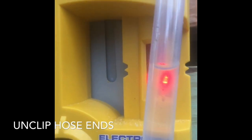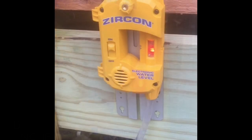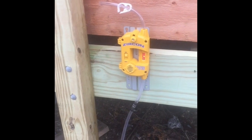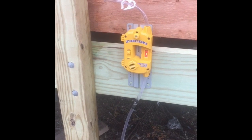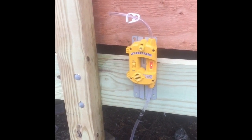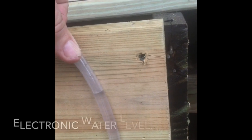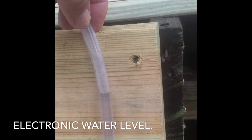Let's move this long tube right over to where we want to measure. What I was just showing you is the series of beeps — you hear a series of beeps when you're real close. When you raise or lower the working end and hear the solid audible tone, that's when you're level. It makes a little beep once in a while just so you remember it's on. Let's go move it over here and see what's level; I need to know if this is level with the original point.